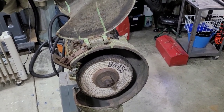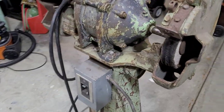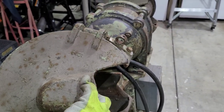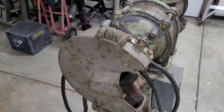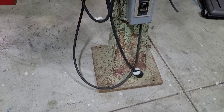This was a production grinder and as you can see they have a lot of nice features, such as a swing-out door. The reason for having a swing-out door is so you can switch out the grinding wheels or buffing wheels and you don't have to remove a bunch of bolts to pull off the guard. In a shop, production is the name of the game and getting things done as fast as possible is what's going to keep you profitable. Now before we tear it apart, let's do a test run.